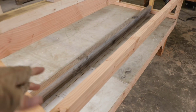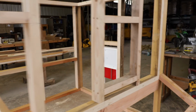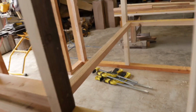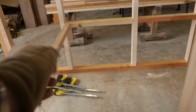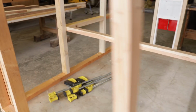Lift those up. You can reach in, get the eggs out. You have the windows right there, so you can look in and just make sure that everything's fine in there. You can see your chickens. The roosts, I would imagine there's probably going to be room for 5 or 6 chickens per roost. And they're 15 inches apart. So there'll be 1, 2, and 3 roosts in there. And those are just the 2x material.